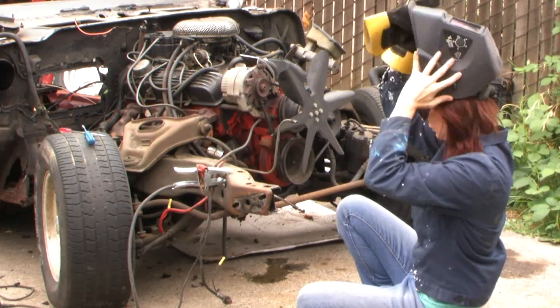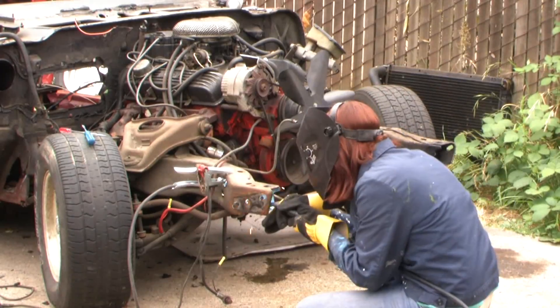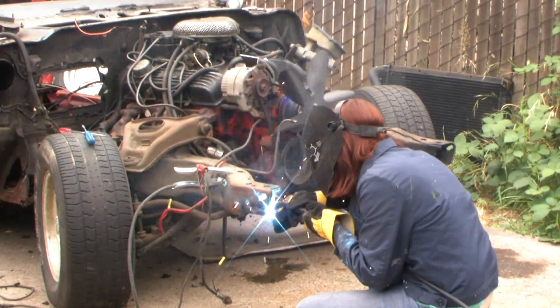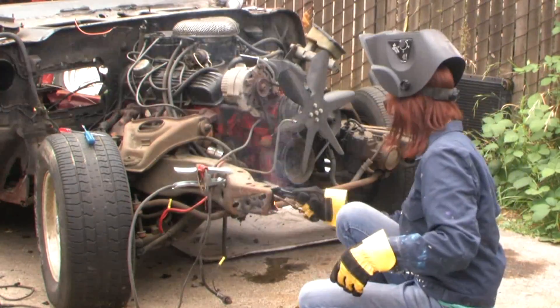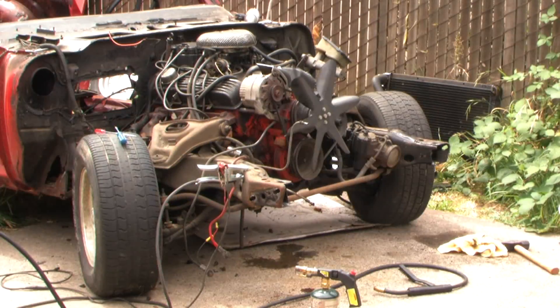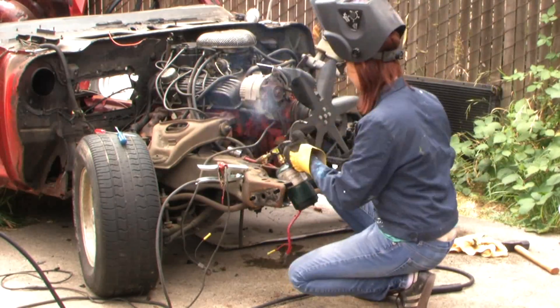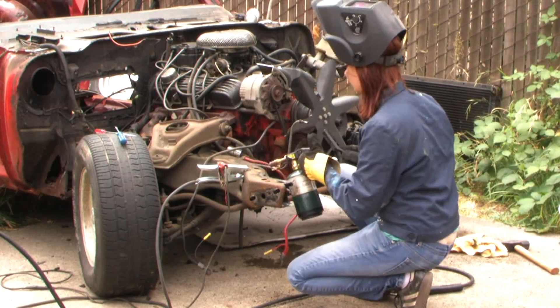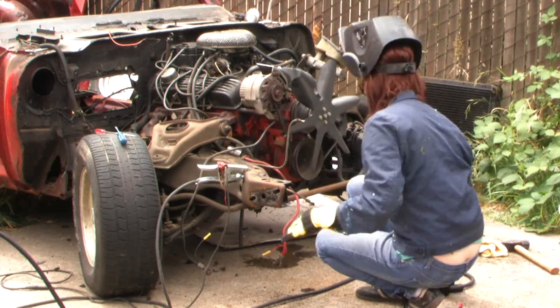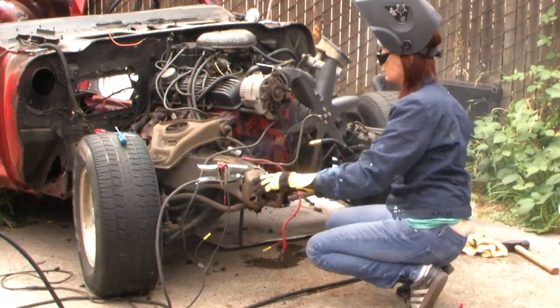This particular car had a little bit of damage up front, so I had to beat some of that metal back together. Constantly using the heat of the weld to try to clean the next area. Now I'm going to work on the top side of the chassis — this is often overlooked. I'm going to re-weld this also, but this is where key suspension components hook in.